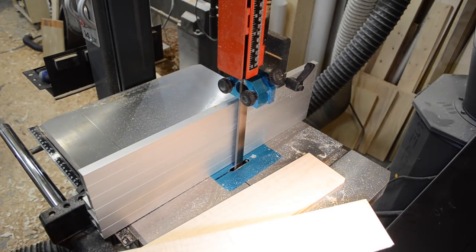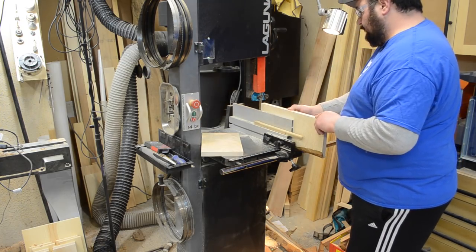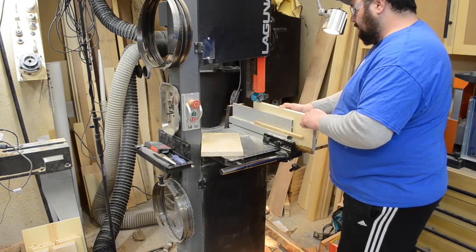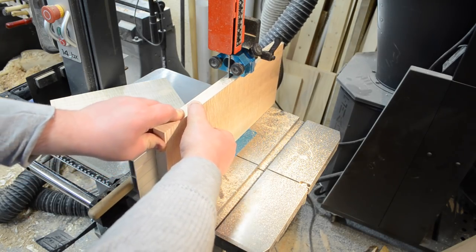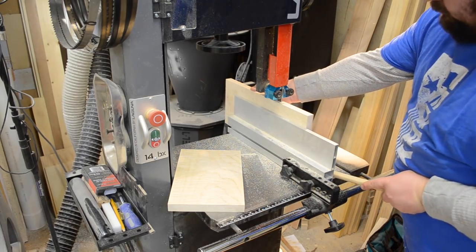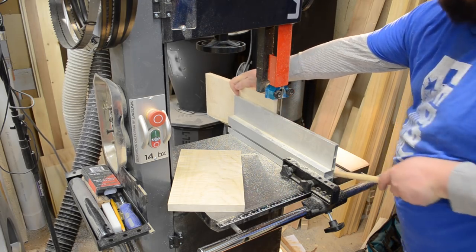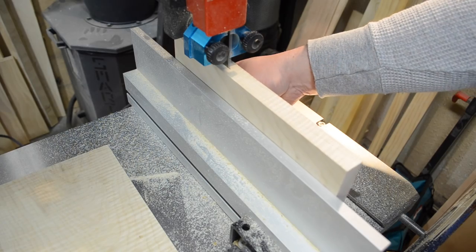For the top and bottom pieces, which were a little bit wider, I raised the guard on the bandsaw and proceeded to re-saw those as well. With the top being a two-piece design, I needed to make sure I had a top and bottom to the top, if that makes any sense. For the bottom, I re-sawed it to save on having to plane it all into chips, and I could probably use that offcut as knife scales or something later on.